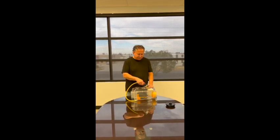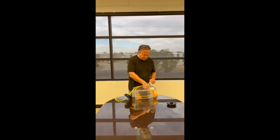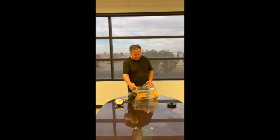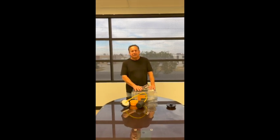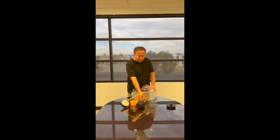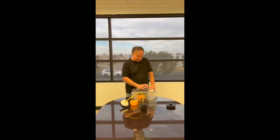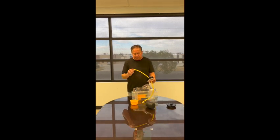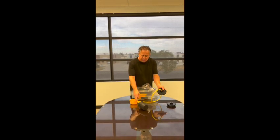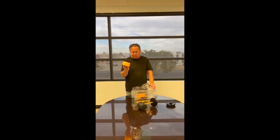After you're done, you simply pull the ball out of the valve and pull the strainer plug out. This eliminates the need for using a chain on the test ball, and it also allows you to stay nice and dry by using this fill port hose. You use the fill port hose, this seal, and our strainer.